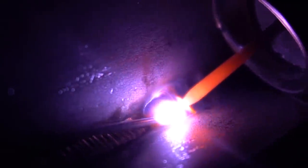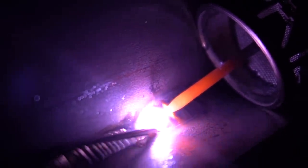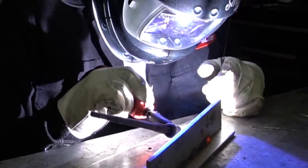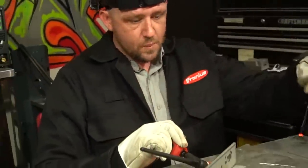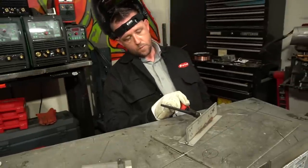It's smooth — completely smooth even on 115-volt input power. It's absolutely incredible. I also have the reverse polarity start on this one, which shows you how crisp and clean it is when you fire it back up and do your restarts. Even as we get in close, running with that much stick-out and that much gas coming out of that giant cup in a joint configuration famous for producing turbulence — you can see how well it maintains composure. That arc is pure butter. This is the type of arc that most welders dream of having — unbelievably smooth.